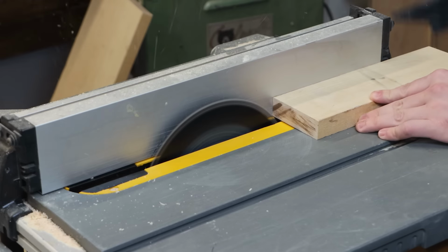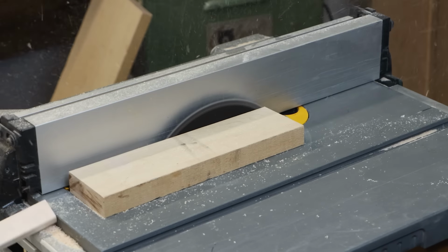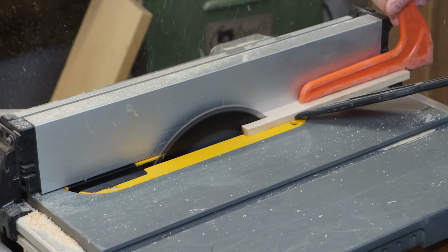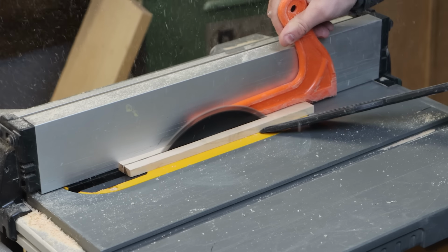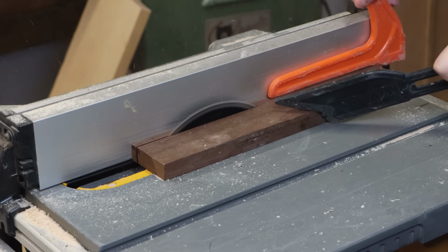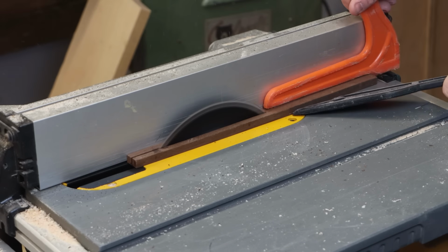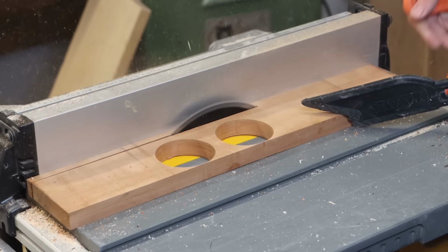That's your jig. So now we're getting our blanks cut out over on the table saw. So what we're doing is we're just cutting these pieces to 3/8 inch thick by 3/8 inch wide pieces. Make sure the wood you're using is at least 9 inches long, because that's how much we're gonna need. So a few of these we're gonna be cutting down to length afterwards, but for now just 3/8 inches by 3/8 inches. And you can see by the cherry piece I'm using, you can really use any scrap wood piece.